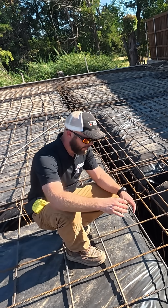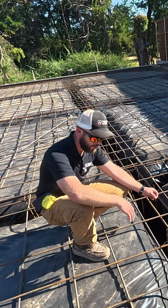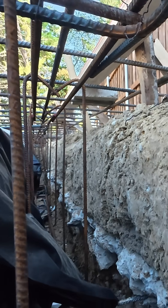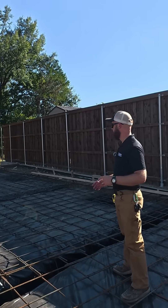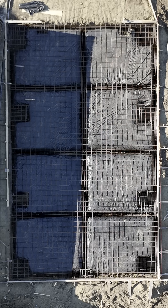The rebar is in place and it's tied to the rebar in the footings, which is a little bit larger — in this case, number five — and we have stirrups every 24 inches. This is giving us strength inside of our beams. What you see here is a rebar grid over a waffle-style beam structure in the concrete.